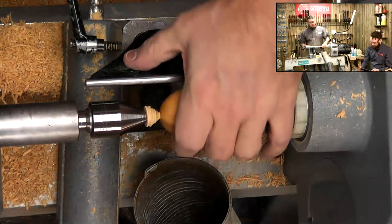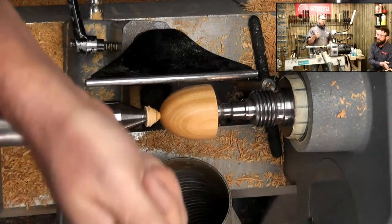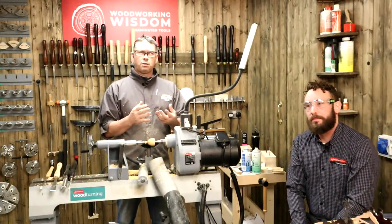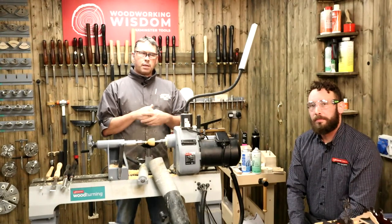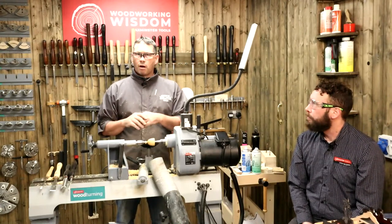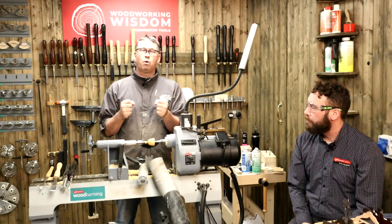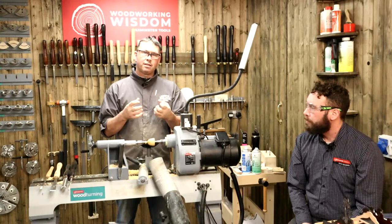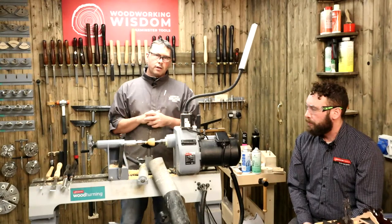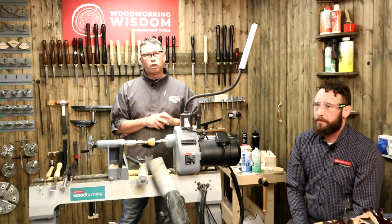Okay. I'll tell you what is out there and what are good. Maybe look at Richard Finley, look at Dave Dolby, look at Steve the Woodturner. They use round and square skews, or almost parting tools, but they're really effective as well. So you've got to use what's right for you and what you feel happy with. I developed those really from that German design because for me, they mean that you're not holding the tool ultra tight. So you get that feeling back in your hand. You can feel the bevel rubbing. Okay, so yeah, have a look at other people as well. Les Thorne's another one, using that sort of square type or round type of skew.